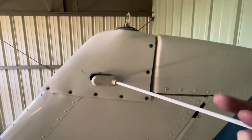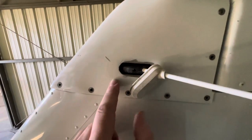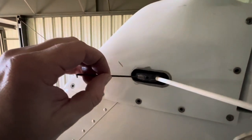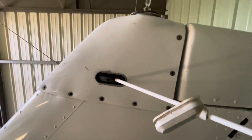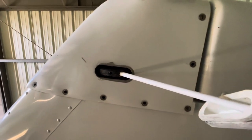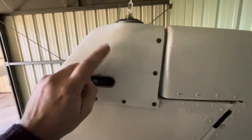You've got to take the VOR antenna off. The later Cessna has these rubber boots — you pop them out, careful not to crack the plastic, and slide the boot out of the way. To take the VOR antenna off, there's a little set screw in there. Take the set screw out, then you can twist and rotate the antenna — these ones are threaded in — and thread it out.